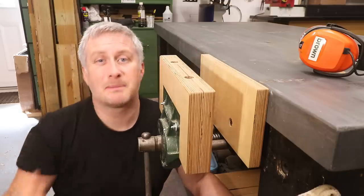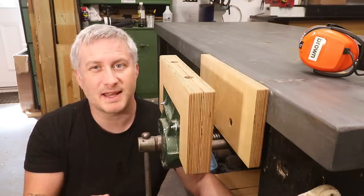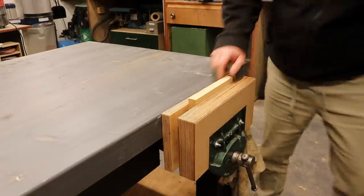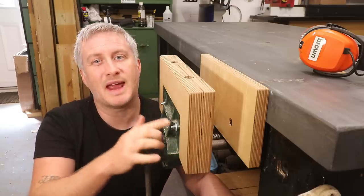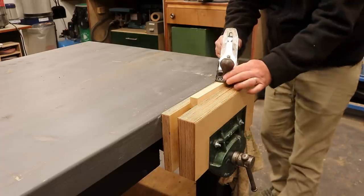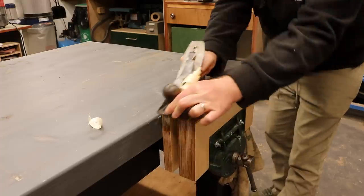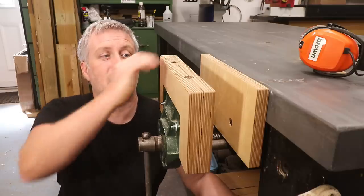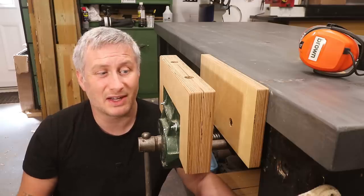I'm confident that the back jaw will be absolutely fine because it's fully supported from behind where the edge of the workbench is. With the front jaw though, a potential problem is that you've only got two bolts holding the jaw in place — so if I'm clamping something quite small at the top of the jaws, these bolts will act almost as a pivot point. Clamp down really hard regularly and it's going to put a lot of strain on where the bolt heads hold the plywood to the front of the vice, and it's probably going to get worn down over time and eventually break. At the moment it works absolutely fine, and for most applications I don't need to apply loads of force anyway. This 25mm birch ply is really strong and rigid and the bolts do a really good job at holding it rigid too, so it might be fine for many years — I really don't know for sure until I give it lots of use.